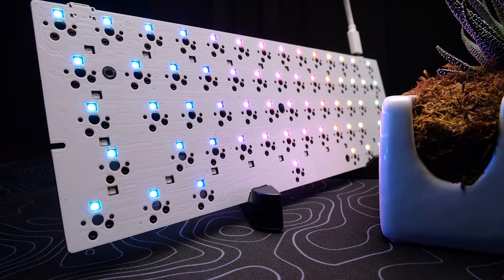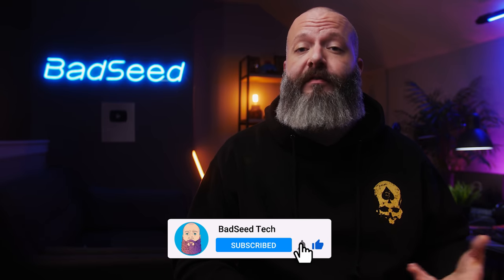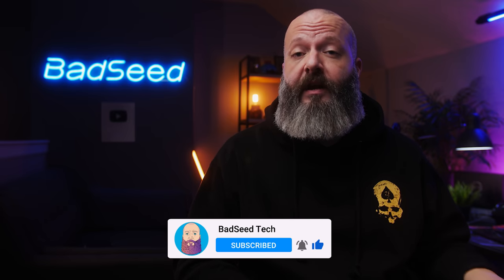You may be thinking, well, this PCB supports 5-pin switches, so you don't really need a plate. You can mount 5-pin switches directly to the PCB. And if this board supported PCB mount stabs, you'd be right, but it doesn't. So unless you have a standard 60% plate already, which I don't know will fit this case or not, you're gonna need to add one, which basically makes your minimum buy-in price $140 US.